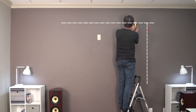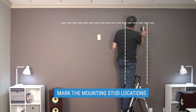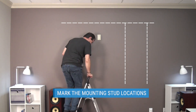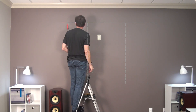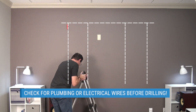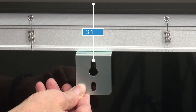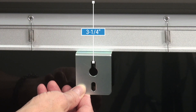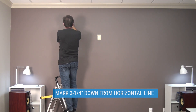Next, find your mounting studs with a magnetic or electronic stud finder and mark their location along the horizontal line you've drawn. If for some reason you can't use the studs for mounting, the 24-pound screen is light enough to be supported by drywall anchors. You'll have to purchase those at your local hardware store — they don't come with the projector. Just be sure before you drill into a wall cavity that there's no plumbing or electric back there. Once the stud locations are marked, you're ready to mount the brackets. The location of the screw holes in the mounting bracket aren't exactly at the top of the image, so you'll have to account for the offset. For the Epson screen, the brackets slip into a wide channel on the frame, and the distance to the top of the frame piece from the screw location is 3¼ inches. So you'll want to measure down that distance from the horizontal line representing the top of the image and mark your screw holes there.